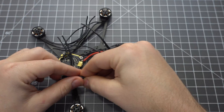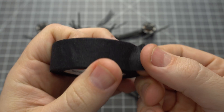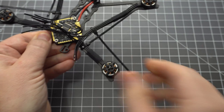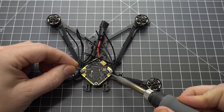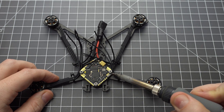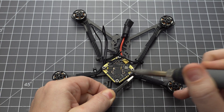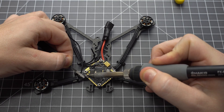It's a really good idea to use zip ties to keep all the wires straight and under a little tension. Then you can use that tension to tape them to the arms with some nice cloth tape. When you solder the wires, try not to add too much solder to the pads — they're really tiny and it's easy to accidentally bridge them. If that happens, just hit it with a flux pen and slice through the middle with your iron.